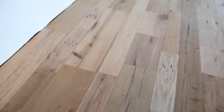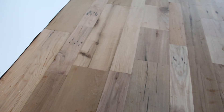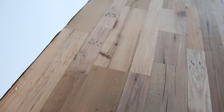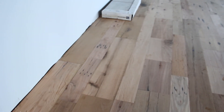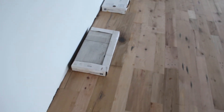Here's another trick: when you're a couple of feet away from the edge of the room, plan your random widths out so the last board falls without needing to rip any off — then you'll have no waste. We figured out which width combinations added up exactly to reach the edge of the room. If you keep your pattern completely random throughout the whole floor, you can use any combination that works with our 4-5-7 width combination. Starting your initial layout based on a full inch increment away from the wall helps too.